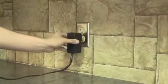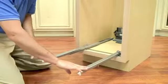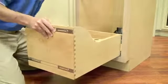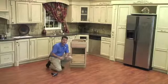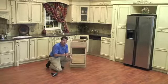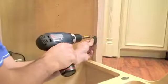Next, you are ready to plug this into a standard 110 outlet. Now that our servo is installed, we are ready to install our wood frame onto our slide system. The easiest way is to remove your slides out from the cabinet, rest your wood frame on the slides, reach underneath and pull the slides into the locking device, and simply slide the unit into the cabinet. In order for your waste container to function properly, you will need to screw in the distance bumpers. If you purchased your unit without the servo drive, these distance bumpers are not required. When installing them, make sure you install the bumpers behind door mount bracket A and bracket B to ensure the unit functions properly.